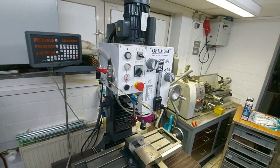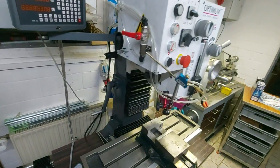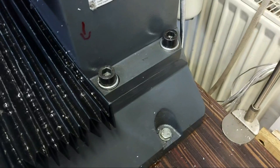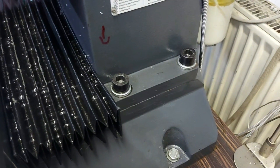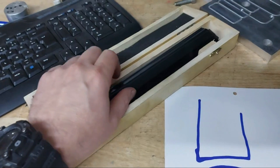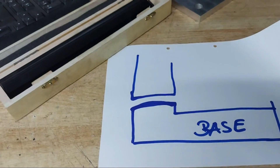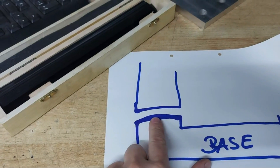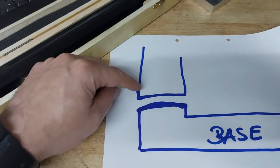I'm quite pleased with this machine but it has a weak point, and there's something I really don't like: this is the joint between the base and the column. The mating surfaces weren't machined very well and this causes some instability in this screwed connection. I checked both mating surfaces against my straight edge and this showed me that the mating surface of the base is crowned, and this doesn't give a proper connection to screw the column on.